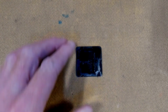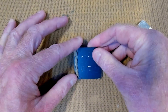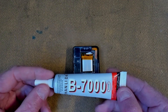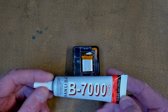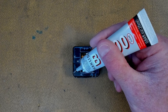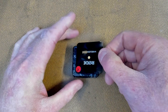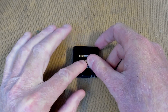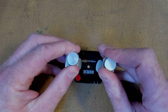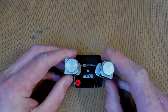I heat the top, then remove the old double-sided tape. I black out any scratches and chips. In the next step we use B7000 adhesive — the same used to seal up smartphones like Samsungs and iPhones. We spread this around the outside, put the top back on, wipe off any excess adhesive, and clamp it up with some micro clamps. We'll let that sit for about a day to dry off.